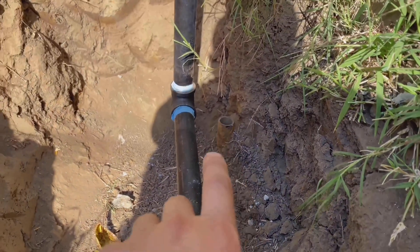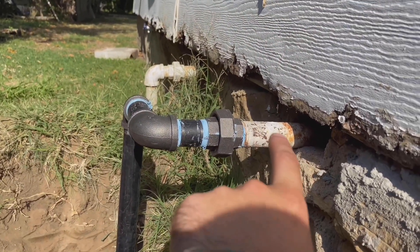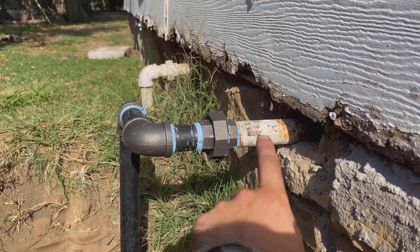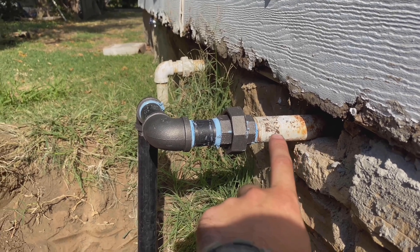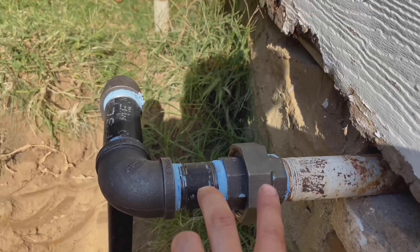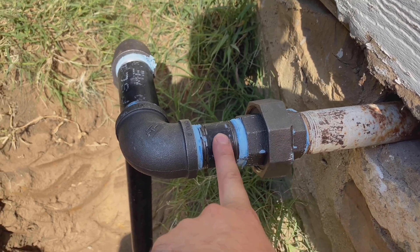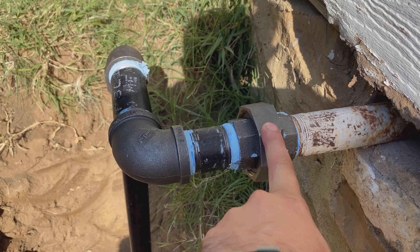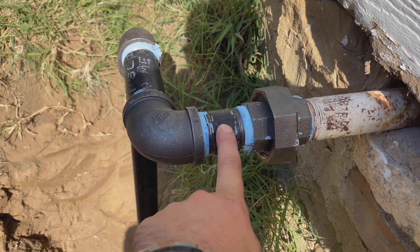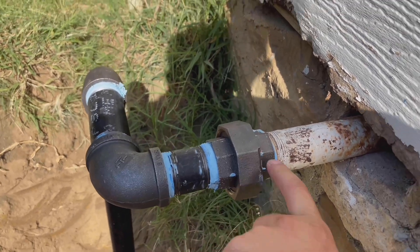Here I am on the other end - all I've done is cut that one and a quarter inch pipe, that 90 up, and it used to connect into right here. This pipe is connected inside all flexible home flex gas line - I've shown you how to do everything inside in other videos. All this is is a union - basically just a little fitting from the store that pulls these two pieces of pipe together. This is a little few-inch threaded pipe so that I can connect this 90 to this union and this union to this inside pipe.